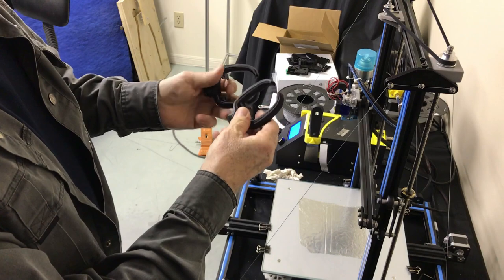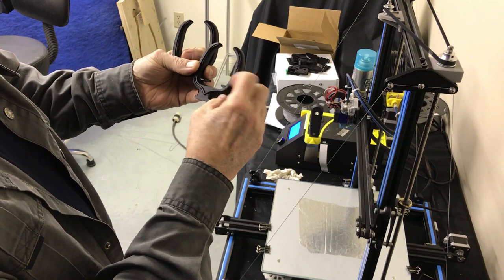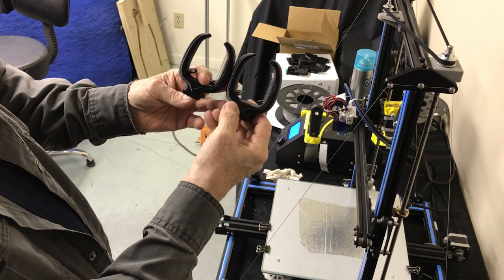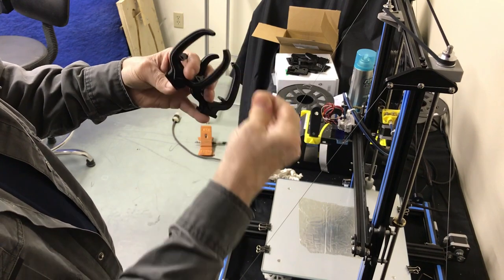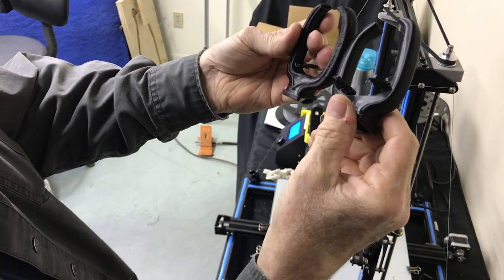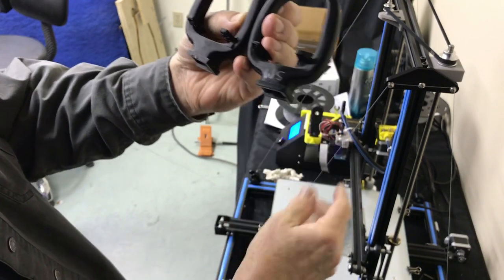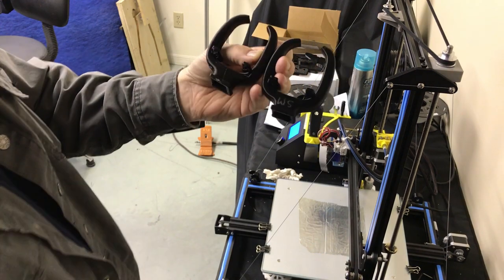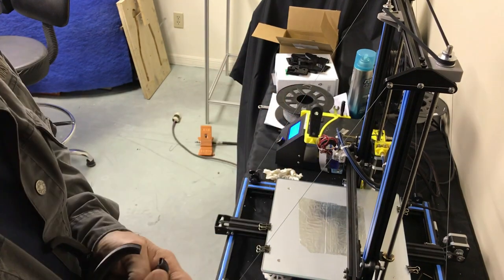This is before. This is the same thing. I think I set the extrusion a little high on this, and I got a little bit of goo on these. But this is the same print using this Creality. This one just did this last night. Just came off. It still even got some hair on it, fuzz on it. But this is, I don't know if you can see that, absolutely outstanding. By leveling my beam and tightening up the wheels on the X beam, I have another video on that, it just turned this into a whole different machine.